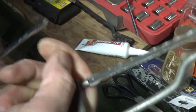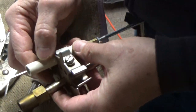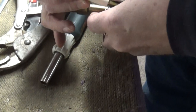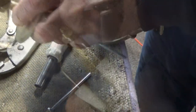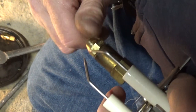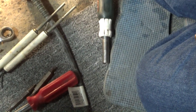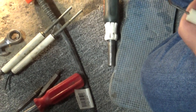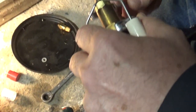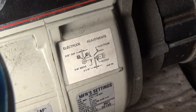I have to get the nozzle in there to adjust them. That's the new nozzle. The settings are stamped right on the burner itself: 5/32nd gap, 1/16th in front, and 7/16th above. We're going to adjust the electrodes now. I'll tighten it up and recheck them.